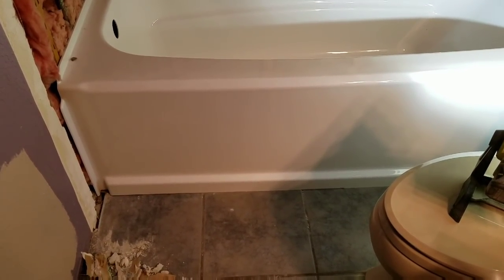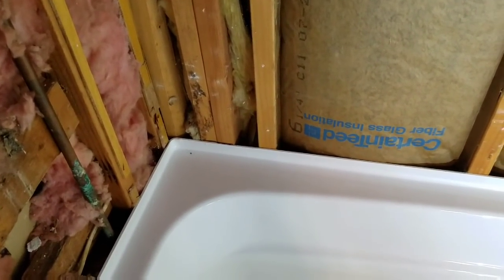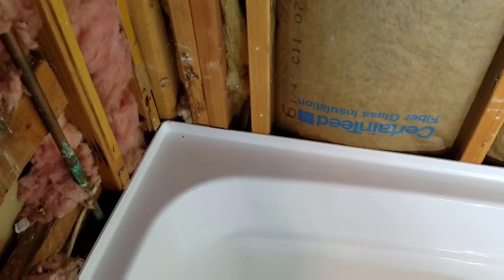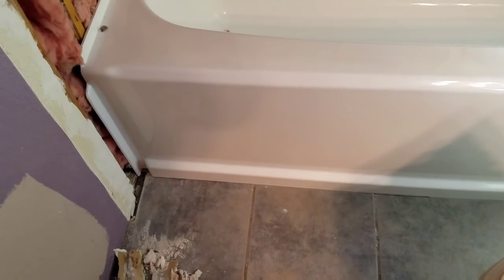On mine, you can see it's on top of the tile, so it doesn't go there — I've got to cut the tile out. So we dry fit and you would make a mark through the paper on both sides so you can see where your holes are going to line up. Go ahead and mark the top of the flange while you're here — you can see I marked the top of the flange right there. You don't want to be putting it in and out 15 times, so pull it out, put it in once, do all the measurements you need. The holes are marked through the paper, so I'll know approximately where they go according to the flange height. Once I get the tile cut out, I'll dry fit it one more time, then double check all the marks and go from there.